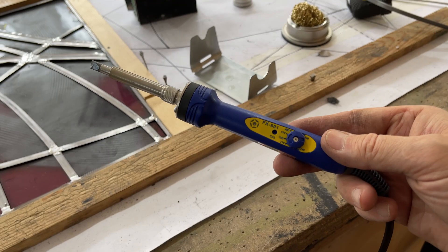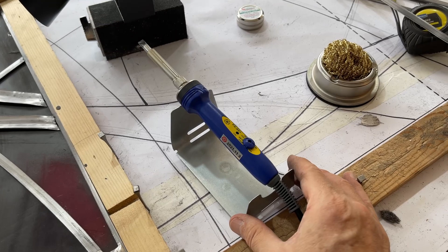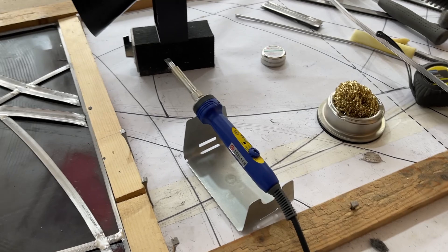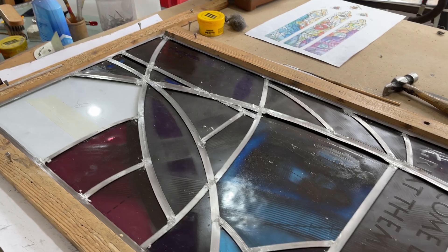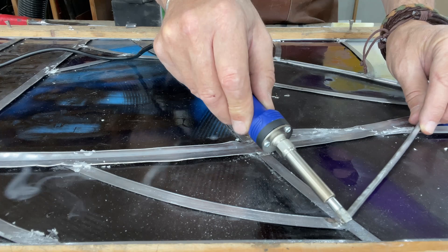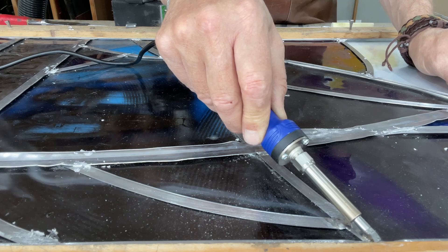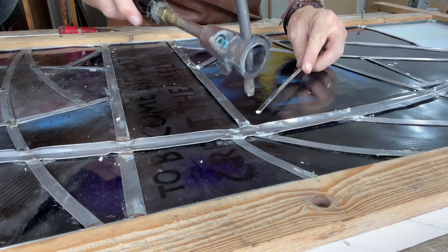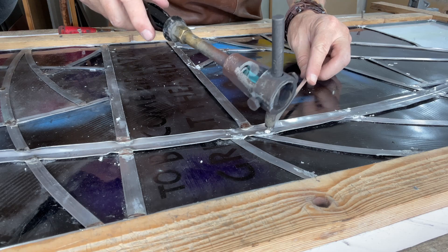The little Hakko I found to be rather small — it's extremely lightweight and I think for delicate work like jewelry work it's extremely good. But for larger scale projects, especially a project the size of a large church stained glass window, the Hakko iron really is a little too small. It was also not maintaining its heat levels even though I was altering the temperature gauge. For long seams, I really had to take two or three goes to get the Hakko to melt the solder across a long joint.